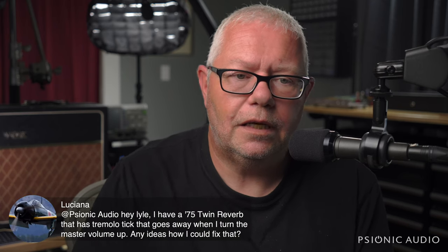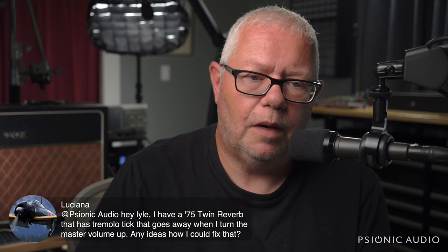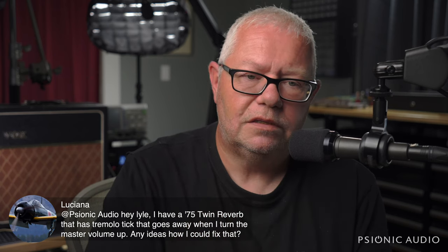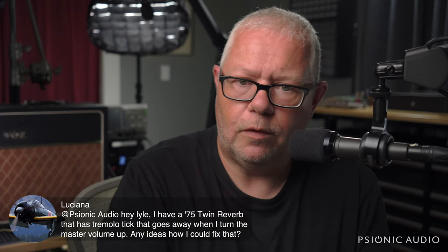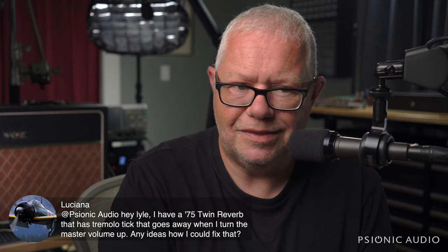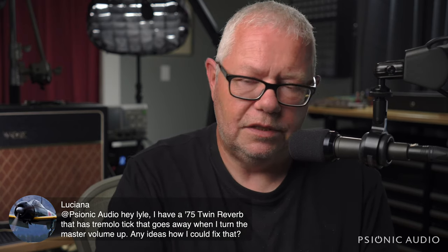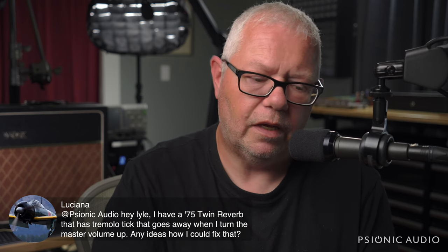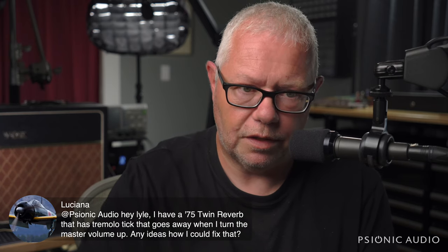Hey, Luciana. Your tremolo tick goes away when you turn the master volume up. Okay, yeah, you've got a 75. It's got the master volume, and the wires going to that master volume are routed right by the tremolo speed and intensity pots. So the best way to fix that is to discharge your amplifier safely, and you can see a video on how to do that on my channel, or you can Google that. There's lots of videos on that.